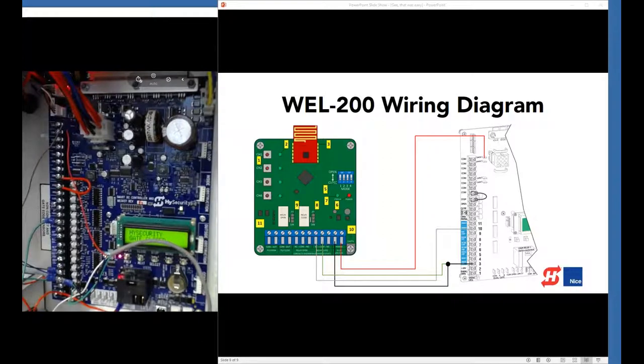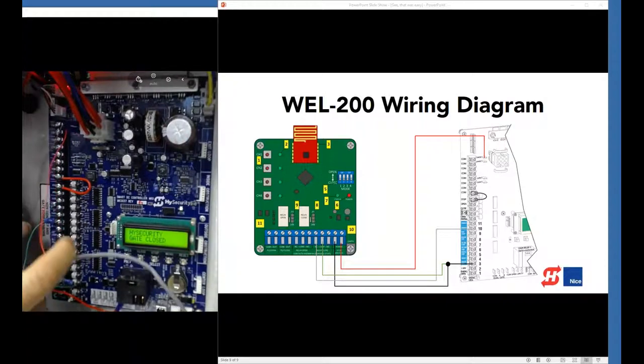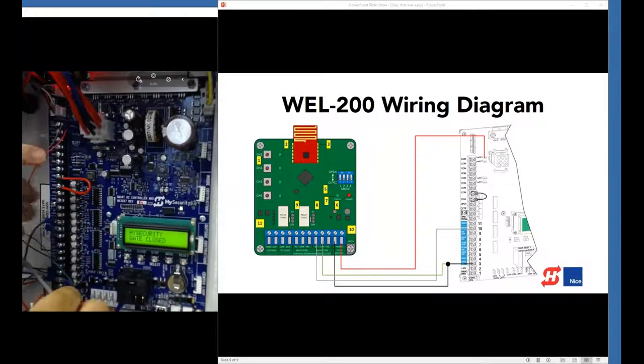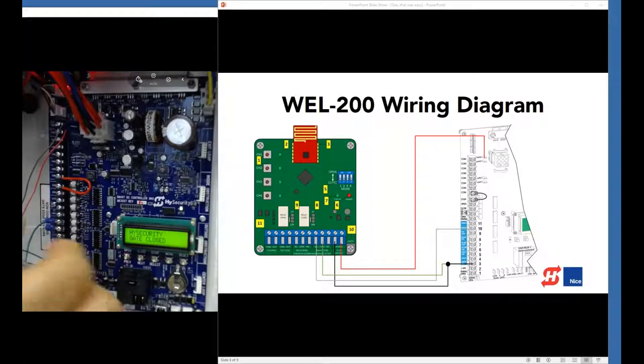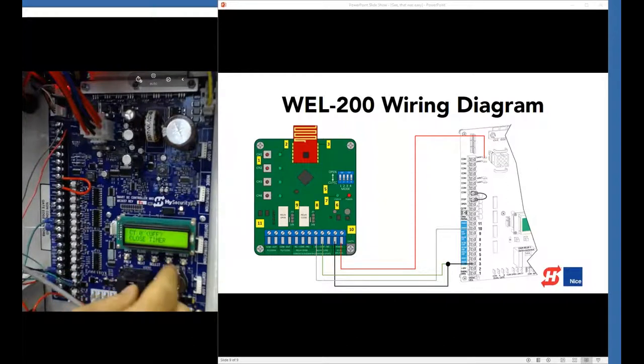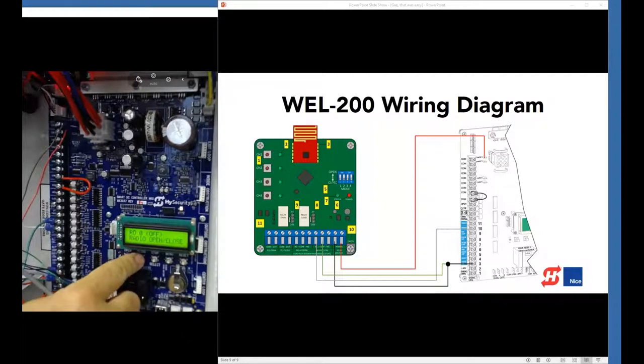I tighten that down — careful to loosen it just enough to land the new lug without losing the ones already attached. Then the sensor input wire goes to sensor 3, the next one down from sensor 2. I'll note: if you're an electrician, I'm a mechanical engineer by training, so my wiring jobs always end up looking like a spaghetti bowl. Let's power it up using photo eye align mode again: menu twice, next until photo eye align, select, switch to on, select, menu.